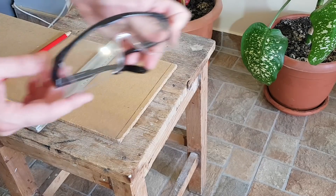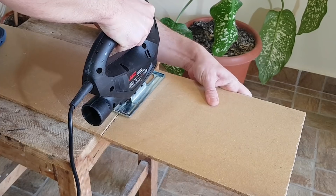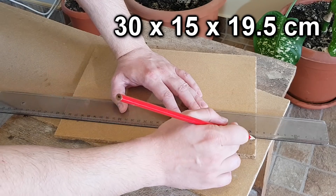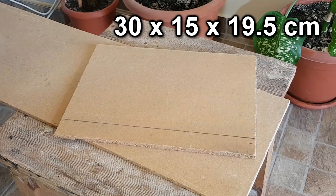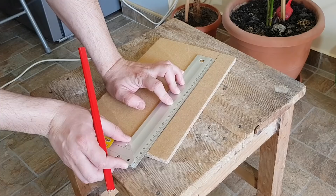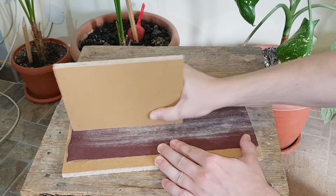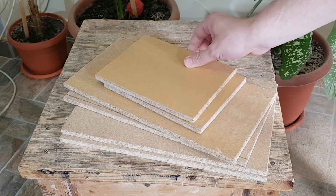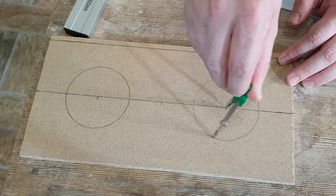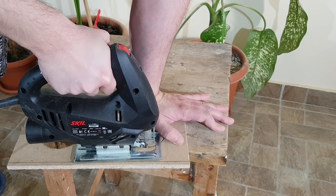So I designed a smaller box and used this leftover MDF sheet with a thickness of 8 millimeters. Remember to always use protective goggles when working with power tools. Now I calculate, measure and cut all the pieces with my limited carpentry skills. In the end my speaker box dimensions will be 30 by 15 by 19.5 centimeters, with an internal volume of 6.6 liters or about 0.23 cubic feet. I will probably lose some of the lower frequency, but I can live with that. After cutting all the pieces, I use sandpaper on a flat surface to smooth out the edges. Now the speaker holes — I measure the outer diameter and use a drawing compass to mark the holes, then use an electric jigsaw to carefully cut them.